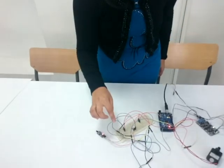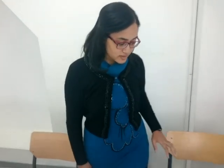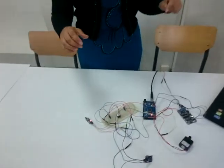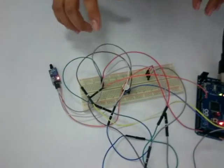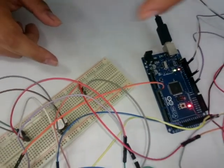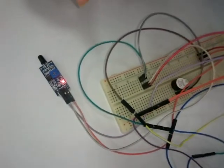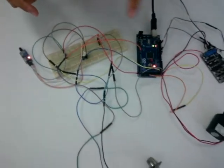I'm going to talk about one of the outputs, which is the buzzer. A buzzer has two pins: a positive and a negative pin. The negative pin is connected to the ground and the positive pin is connected to one of the digital pins on the Arduino. We also have a breadboard where one node is the VCC — it connects the VCC from the smoke sensor, the flame sensor, and a wire from the Arduino — and another node is the ground, connecting the flame sensor, the smoke sensor, the buzzer, and the Arduino ground.